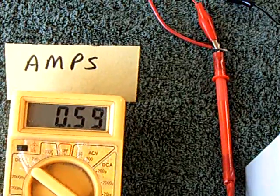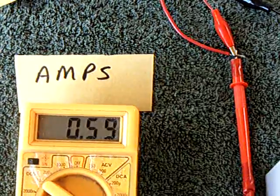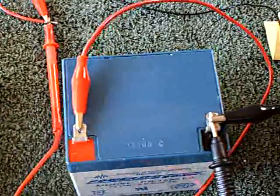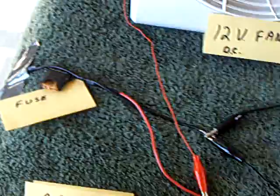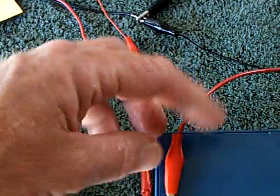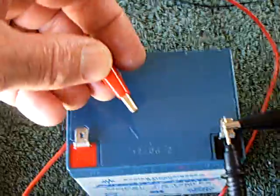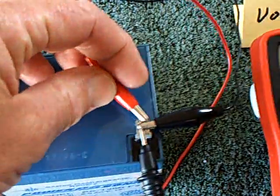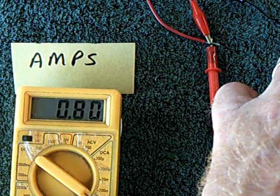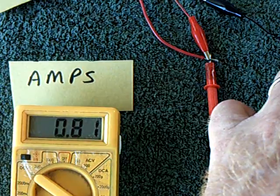This is the situation with the solar panel going into the battery — there's amperage and voltage right there. This is coming right off the solar panel, and this was really scary for me, but I did some research and it is true: if you take the solar panel and short it out, voltage goes to zero, amperage goes up to what it's rated at at a short circuit, and this is usually listed on the back of the solar panel.